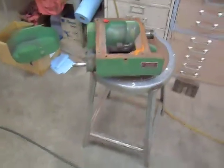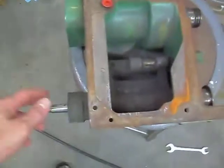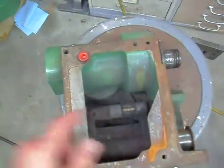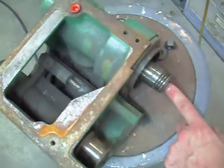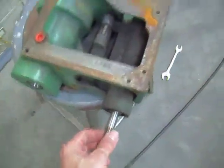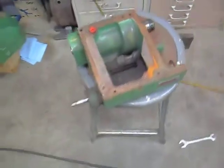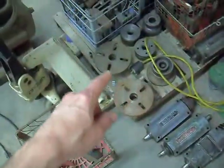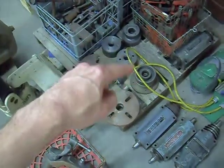I kind of took it apart to clean it, but it's also just so heavy — I'm going to put it on the machine in pieces. This is the spindle. It's got some left-hand threads, and a Brown and Sharp number seven taper goes in there. It's got a very small — I think half-inch or seven-sixteenths — draw bar hole through there. I've got a whole bunch of attachments for that threaded spindle: face plate, face plate, chuck adapter, chuck adapter, chuck adapter, and some other adapters.